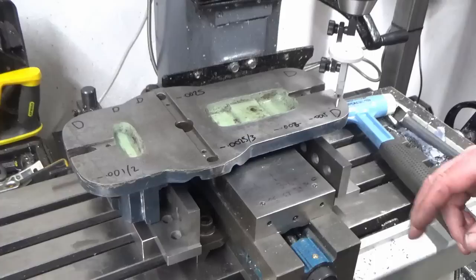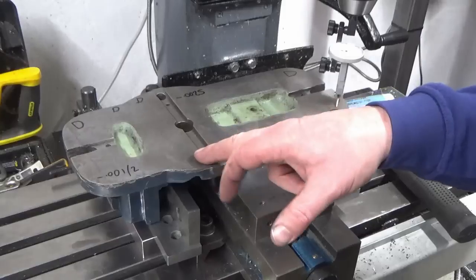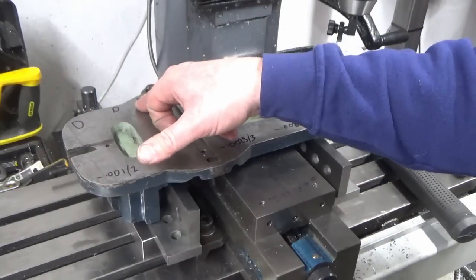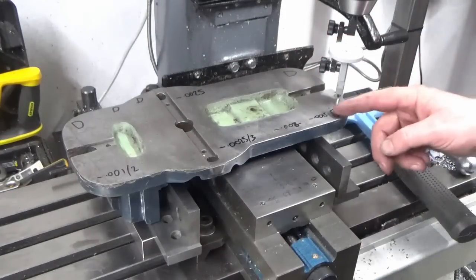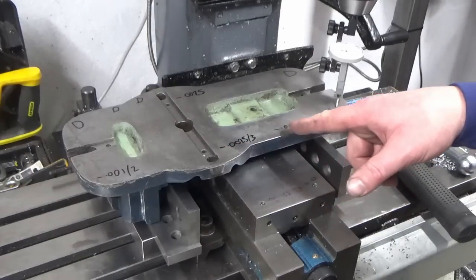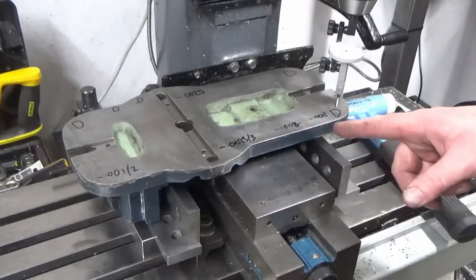so that's all nice and firm. And then what I've done is transferred my markings from what I found on the surface plate with the feeler gauges. So where I've got a D, I've classed that as datum. That's where I couldn't get the 1.5 thou feeler under, in the corners largely where it was touching, and then where I could get the feelers under, I've put a bit of an approximation of the kind of size in imperial of the feelers I could get underneath.